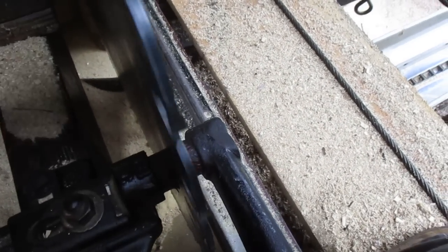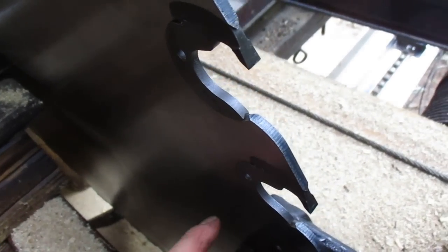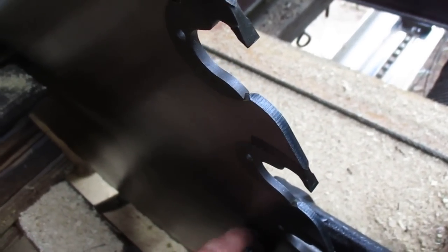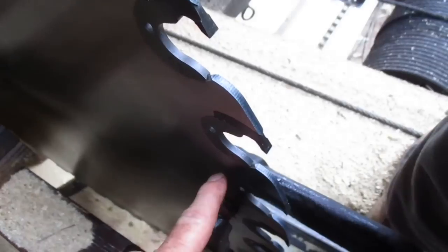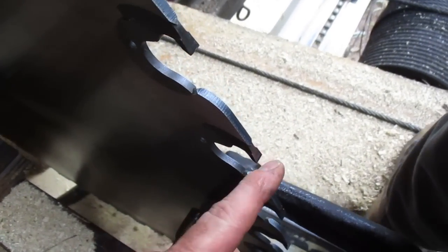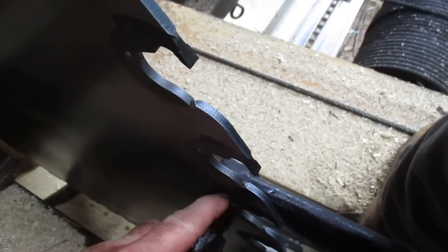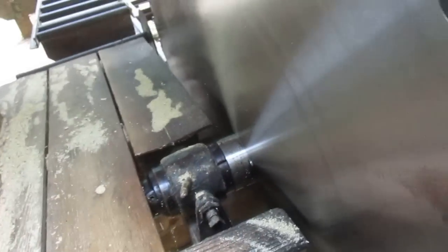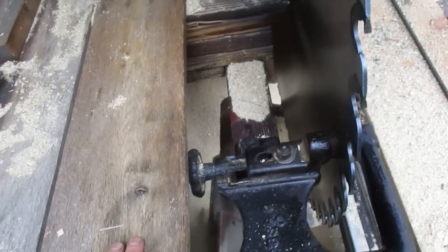So I'm going to put a dial indicator. If I was smart enough, I would have remembered to bring it down at this time. So I'll put a dial indicator on it to change the lead on it. And right now I know I'm perfect at 1 inch. So if I put a dial indicator here and put it right here, take the guides back, I can move it. And then when I start tightening this, move it exactly to where I want it. I wanted to move it this way 1/16 of an inch. So once I zero it in at 1/16 of an inch this way, then as I start tightening the different nuts on this thing, if I see that indicator move, then I'll stop on that one and go to another one until I get everything as tight as I want it. So that's how I do that.